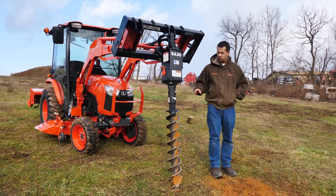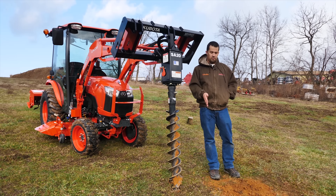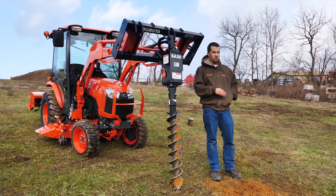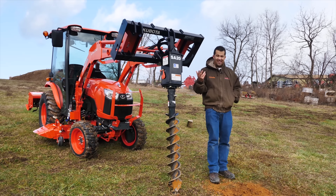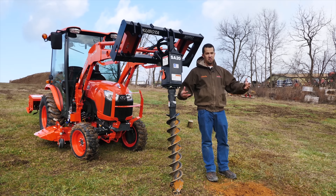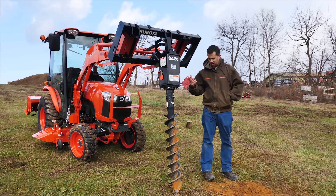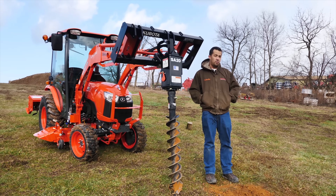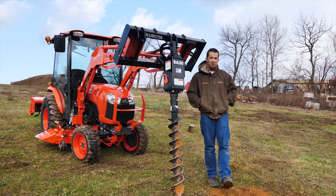Having run these before, this is a really small auger. I've run a tractor-mount version with a bigger auger and did start to feel those torque limits getting to larger sizes. This is something you really want to keep in mind for post holes and that kind of thing, but not something I would want to be running with 12 and 18-inch augers regularly, because you'll find those hydraulic limitations fairly quickly. You could use an attachment like this, or if you have parts or service needs for equipment you already have, give us a call at Messick's. We're available at 800-222-3373 or online at Messicks.com.